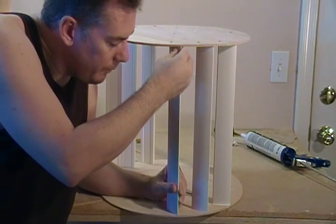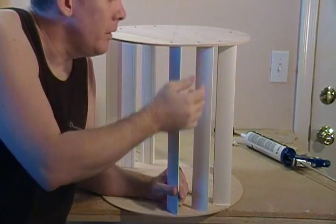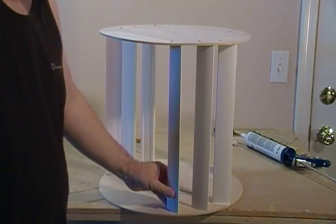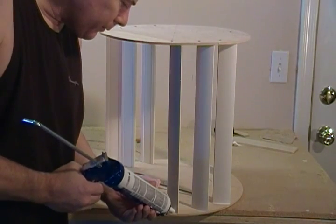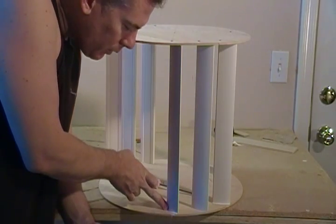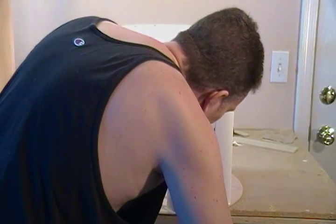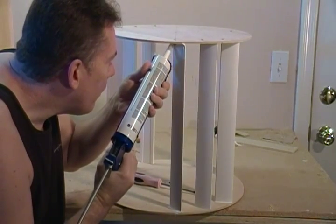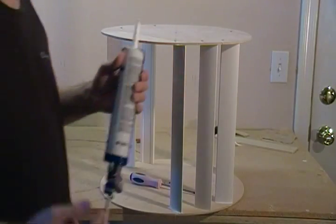...right there at approximately 41 degrees — which works out if you drill your holes right — you set these in here and rock them out close to your edge. Then we're going to take some white silicone and silicone the blades into the corners, front, back, top, and bottom. That actually makes it a fairly strong structure, and the silicone has a little give to it as well, which is helpful, rather than using wood glue. The silicone sticks to this interior really well.